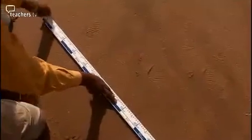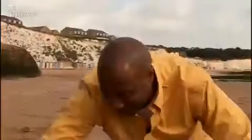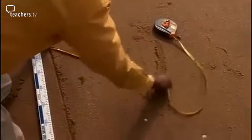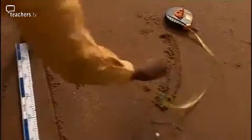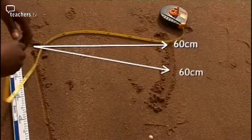If you don't know any of the angles in the triangle, it is impossible to draw with just a ruler. I can draw one side measuring 80 centimetres, but to draw the other two sides needs a completely different approach. What I need is a piece of string or a cloth tape. If I attach the cloth tape to this point here on my line and go as far as 60 centimetres and draw the arc of the circle, that gives me several places all 60 centimetres away where the second side of the triangle might end.